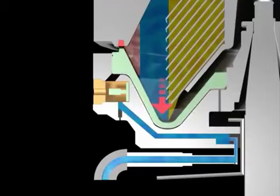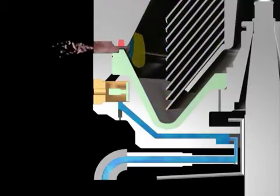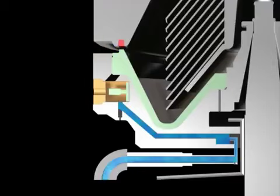When the operating water in the valve opening chamber is discharged, the hydraulic pressure inside the separation chamber causes the valve cylinder to slide downward. The dropping of the valve cylinder causes the sludge discharge outlet to open, and all sludge and liquids are immediately discharged from the separation chamber. When discharge ends, the supply of valve opening water stops. All of the valve opening water is released through the drain nozzles.